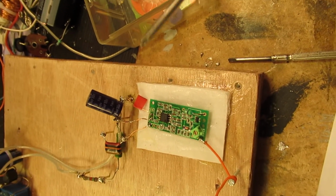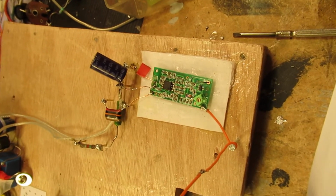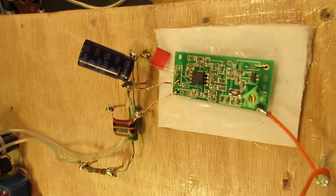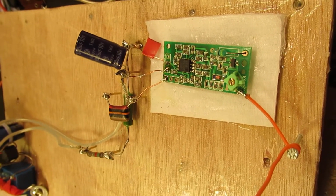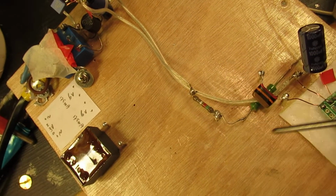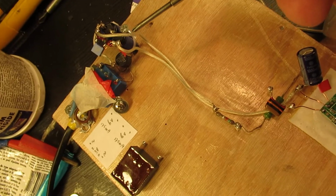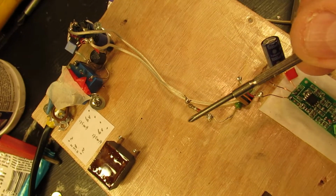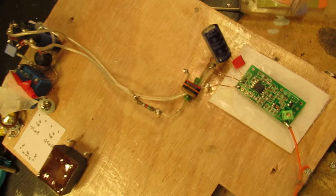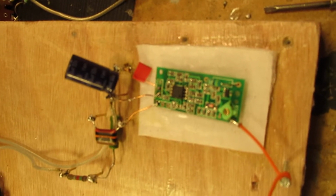But anyway, I could damp out all these strange effects, oscillations, etc. by mounting here between the positive and the negative a 1000 microfarad capacitor. And also important to tell, there is here a series resistor, there's another one here. Together they are approximately 2000 ohms. So out of this mini transformer there is a resistor of say 2000 ohms. It goes to that 1000 microfarad capacitor that bridges the receiver, and then it all works fine.